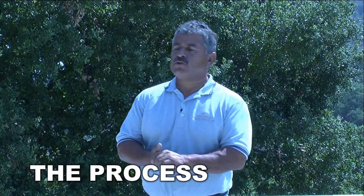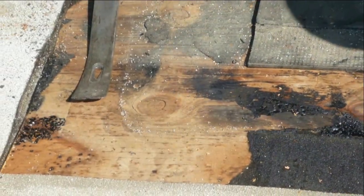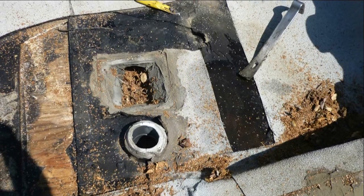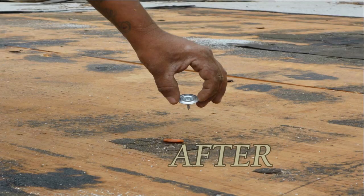This is what we've done. We tore off the existing roof covering and put on a new roof covering. The failure of the old roof covering was found in the inspection after we removed the old. There was a hidden one-layer hot tar roof covering, plus the new roof covering. The base sheet was fastened with plastic caps, which is not really recommended for a flat roof — they're supposed to be steel caps, one inch.